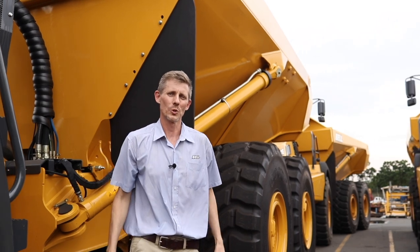Now we've seen your Bell traction control in action. I'd like to make two other points. First of all, the large Bell machines have got a system called CTD — it's a cross-traction device that locks the left and the right wheel in case there's further slip. And something else really important to note is that your Bell will also disengage all the traction control devices at the right time to make sure that your tires don't wear out.